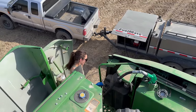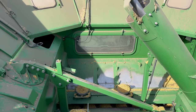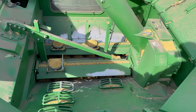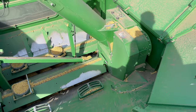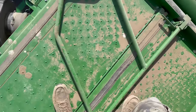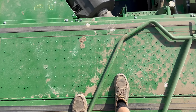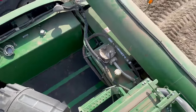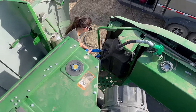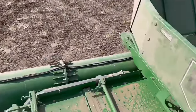Allura is filling up the combine with fluids and giving you a tour of the top of the combine. For those of you who don't know, this is where all the grain is stored. That little window right there is where I sit. This auger brings grain up here. Those augers in the bottom drain the grain tank, and there are little sensors everywhere for moisture and weight. Also little windows up top so I can see how full it is. This platform I'm standing on is actually the engine cover — the hood of the combine — because the engine is underneath. That is the air filter right here, the hydraulic system, a huge fuel tank, a DEF tank, and the radiators are right there.